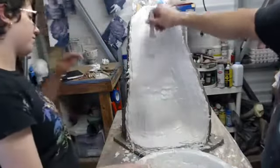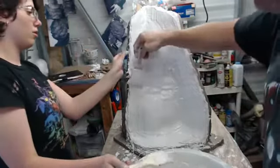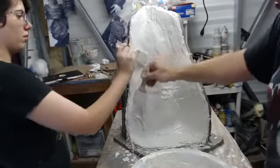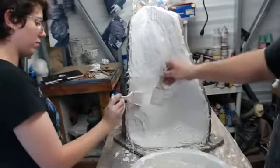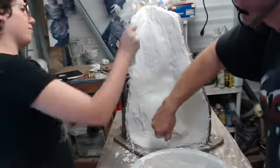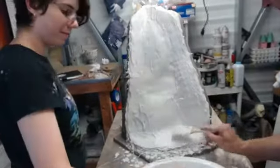Can you tell by looking at that wall thickness over there where we are? Mm-hmm. Here it's this thick. Okay, so we're close to an inch, maybe? Thinnest, it's this thick. Okay, so half an inch. Yeah, if we can build up a little bit more there, I would feel a lot better. Don't put a pry point there. A what? Just don't put a pry point there. That's not a game I want to play. Yeah. Oh, it's getting very thick. So, start the next batch.